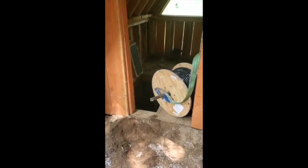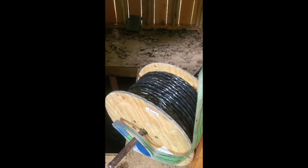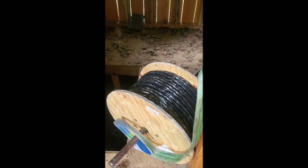Wasn't so bad — we got the wire all set on the spool. I'm just gonna hang it off that hook here and have it hang just over the top of this opening. Right down there is the two-inch conduit that we're pulling it through, so it's gonna kind of hang above the door, spool wire out into that two-inch conduit, and we're gonna pull it all the way to the cabin — 218 meters of 10-3 wire apparently will do the trick. Just gotta wait for a special guest to arrive before we start pulling.